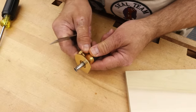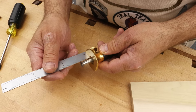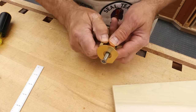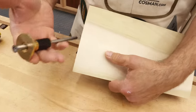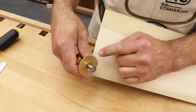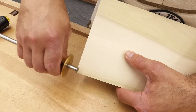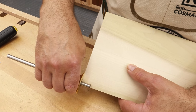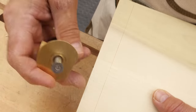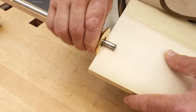So the first thing I'm going to do is set it. I just put a little bit of tension on the thumb screw. If I want it at three-quarter, I've got to come out a little bit farther, so I can just tap the rod. Went a little bit too far — tap the cutter. I'm going to get it where I want it, lock that down nice and tight. Now, if I'm going to scribe all the way around this board, I find it much easier to pull. I hold it so that the thumb screw is in between my thumb and my index finger. You want to concentrate on the head of the tool up against the end of the board. Forget about the cutter — that's going to do its job. But keeping it tight here is what's really important. You can do it all in one pass, or if you find it a little more easier to control, do it in several light passes. Pull it toward yourself.